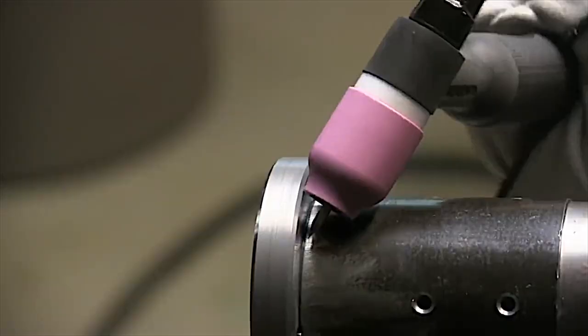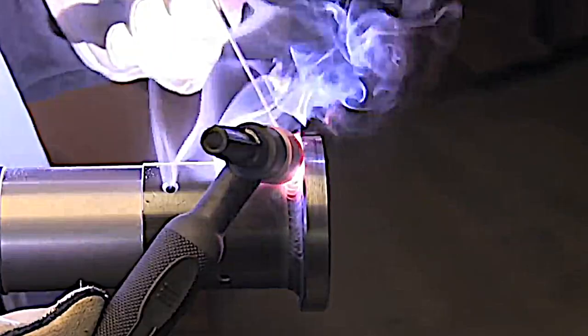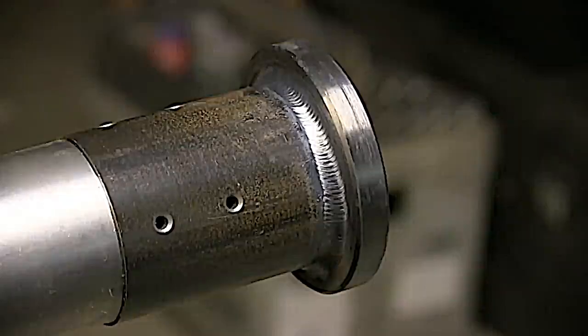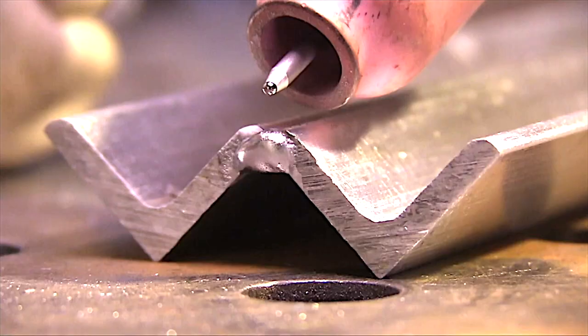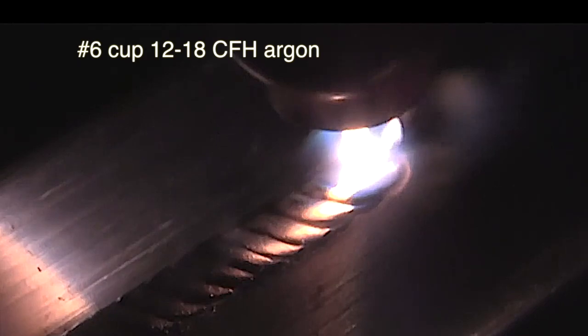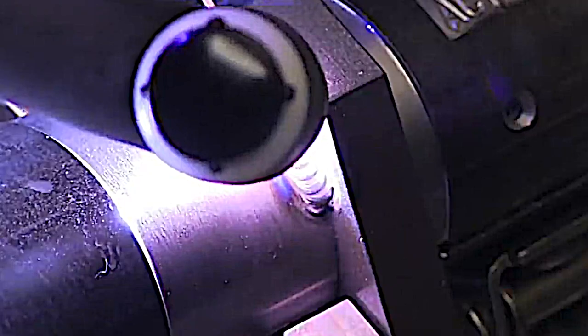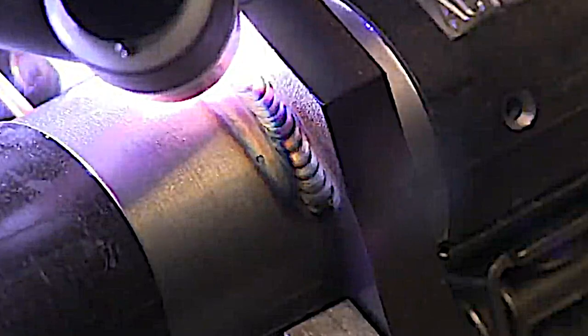Another reason to have a good assortment of cups is sometimes you might get into a situation where you're walking the cup on a small fillet weld. You don't want to use a whole bunch of extra gas — it doesn't require it. When you've got that cup right up against the metal like that, it requires a little bit less gas flow than if you've got a long stick out and are freehand welding. A number 6 is also a really good all-around cup for aluminum. This is an outside corner joint on eighth-inch-thick material. If you need a little longer stick out than you can get with a 6, take it up to a number 7 and just increase the argon flow. About 2.5 CFH per cup size gets you right in the ballpark usually.